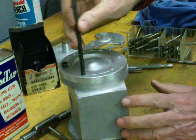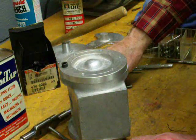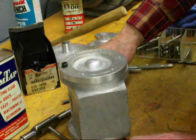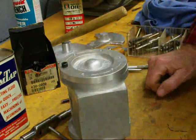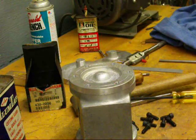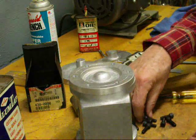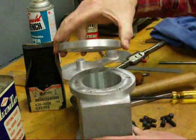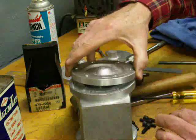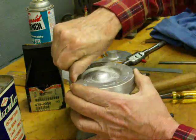Now that isn't going to move. We can go around and mark the other five, then drill them and tap them, and secure that everything is going to line up. We've got the six holes drilled and tapped and deburred and blown out, and now the acid test here — we'll see if everything lines up.